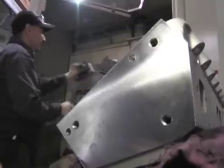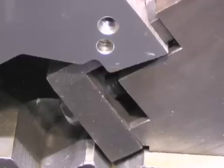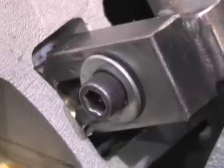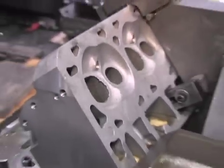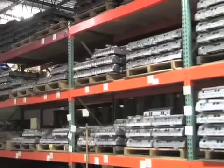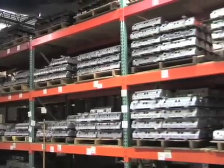As opposed to five years ago, today at Dart's machining facility we can measure things in tenths, not in thousandths anymore. We're able to machine an entire cylinder head and hold tolerances within tenths — a tenth is the plastic of a cigarette wrapper divided by ten. But more importantly, for a company consistently trying to reach as many people in the performance industry as possible, is that we can hold those tolerances in volume.